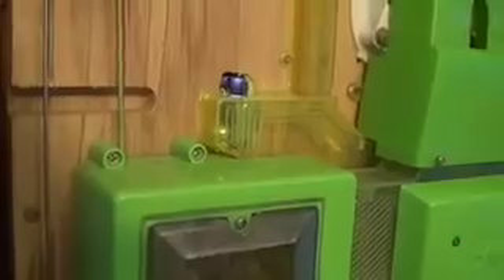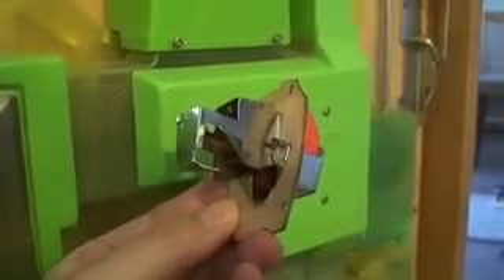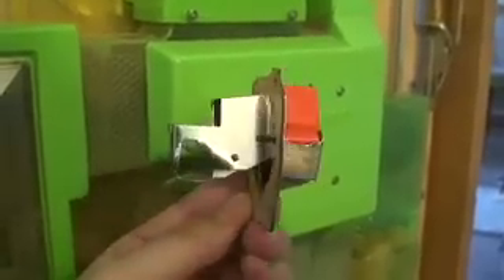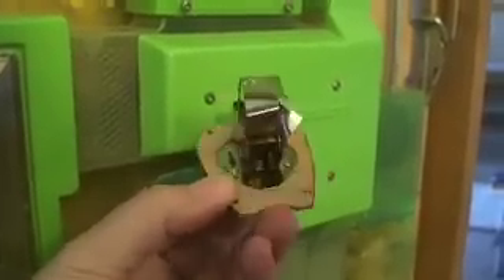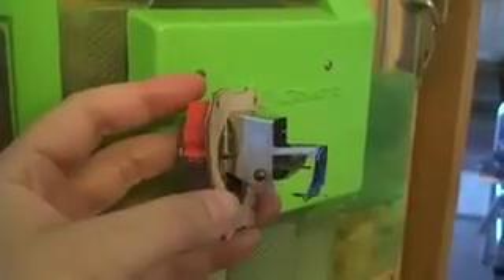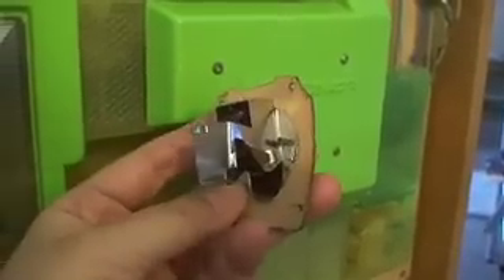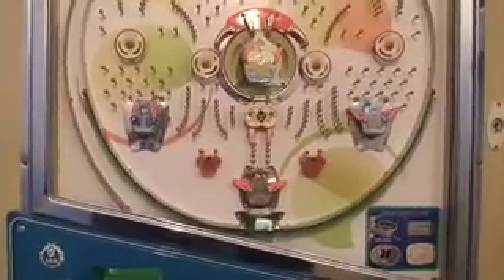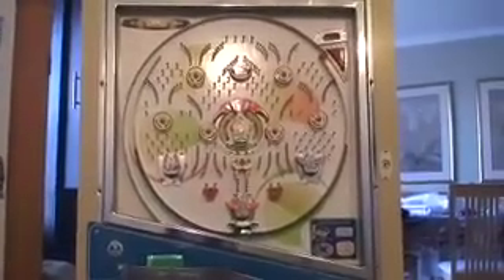Then I'll have to figure out how to make the ball come out the other side. Here is the ball coming out of the wrong side of the tulip — this is unfortunate. I can't think of a way to get it to go underneath. This is the now modified tulip so that the marble will come out on the left side as you're facing from the front. I bent that thing open, flared that edge corner where it was sticking, changed the angle of this bottom piece, and turned the bias of the brass so that it's to the left instead of the right. It works, at least out of the machine. Woohoo! It is done and I now have three tulips instead of one. It's a beautiful thing!